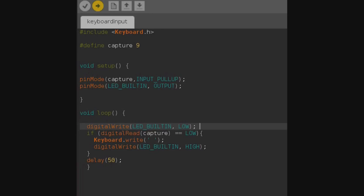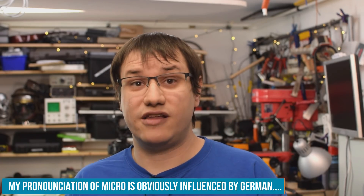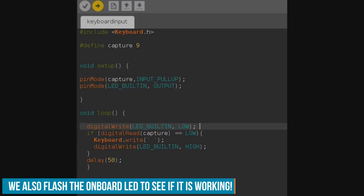Let's look at the Arduino code — it's not very big, I promise. It's quite simple. First, we include the keyboard library so we can send keyboard commands with the Arduino. Keep in mind this works on the Latte Panda because it has an Arduino Leonardo — you can also do this with an Arduino Micro, but you'd need additional software for any other Arduino that doesn't support this library natively. We set up the pins in setup, then open a loop. All we do is check if the button is pushed, then send a blank space — the spacebar — over USB, which Entangle recognizes and uses to activate the shutter. If the button is not pushed, don't do anything, then check again. That's all you need. Easy.